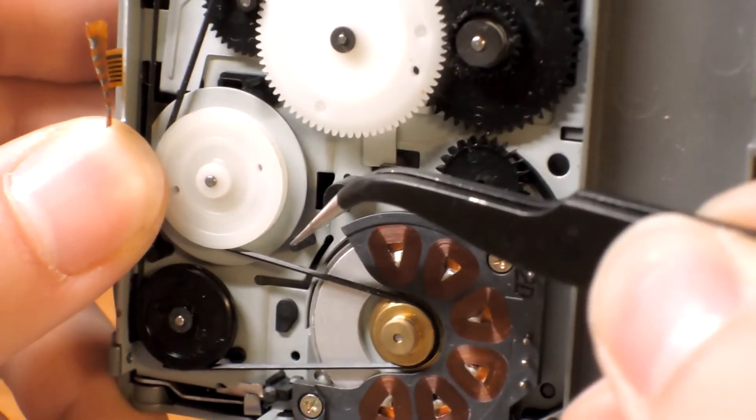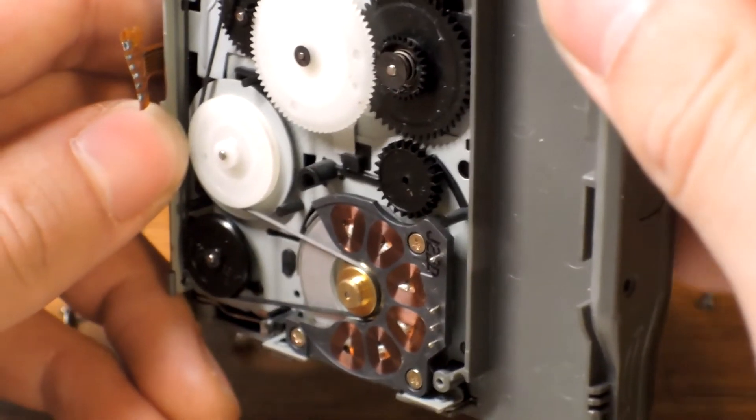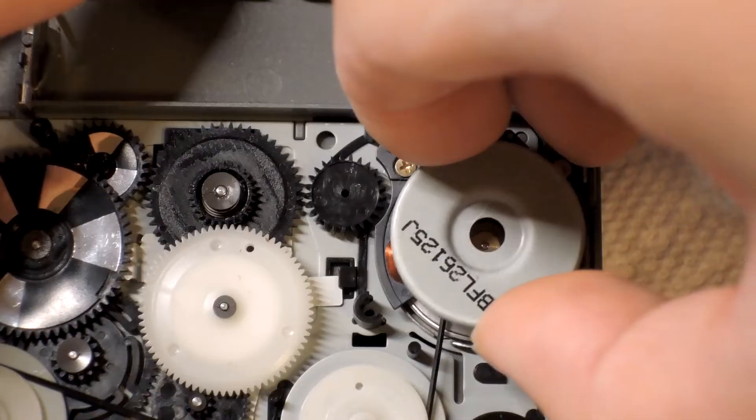Since these are generic belts, you might get a rough corner. In my case, there's the rough corner. Just have it facing away from the spindle of the motor, because that might cause some unwanted wow and flutter. So that's what I did there.